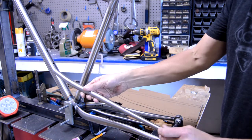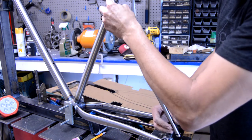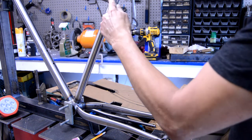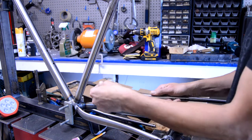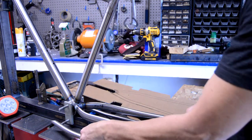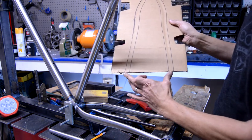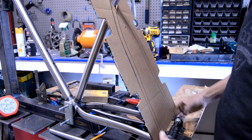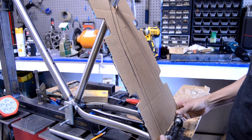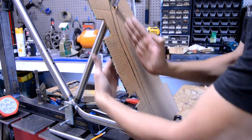At this point I just need to notch the dropouts, but I went ahead and notched out the tops of the seat stays. For notching, on the last bike frame I built I just cut it off with a hacksaw and gradually filed it until it fit. This time I made a little cardboard template - the dropouts are going to rest right on that plane. Kind of a cheese-ball method but it worked.